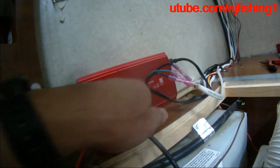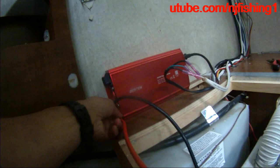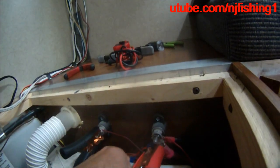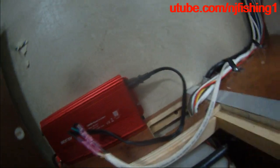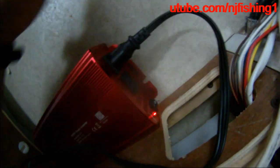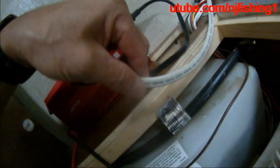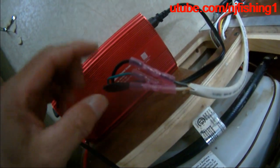This is to invert DC 12 volts to 120 volts. These two cables — red and black — came from the inverter. What I'm doing here is connecting to this AGM battery down there. You can see there's a power switch. I turn on the power switch, the green light is on, and this pigtail connects to the 14 gauge wire — green is the ground, and the others are hot and neutral.